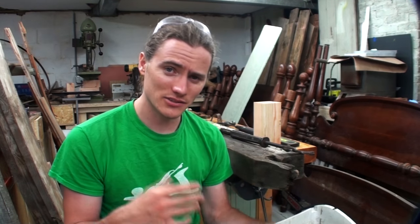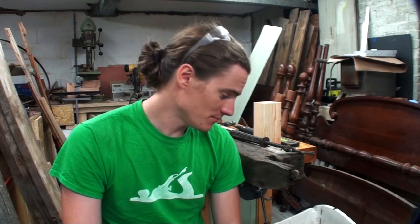Another thing to keep you from wasting time: a lot of reclaimed lumber from old houses has a lot of nails at both ends where it was toenailed in at the bottom and top. The easiest thing to do is just chop that off, as long as you'll still have enough wood for the project. A lot of times the wood is too broken up right there at the bottom from all those nails, so sometimes it's a lot easier to just lose a little bit of material rather than trying to save it.